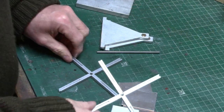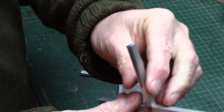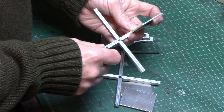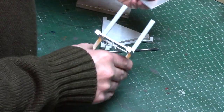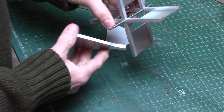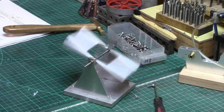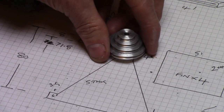This is my little version of the baker fan to run on the wigwag. It was basically made from six millimeter aluminium square bar with some slots down the sides to allow the flat plate blades of the fan to be inserted. A hole through the center for the shaft was made, and the shaft could then be fitted to two uprights which will be bolted to a base. A small four-step pulley wheel was also made so that it could be regulated on the engine.